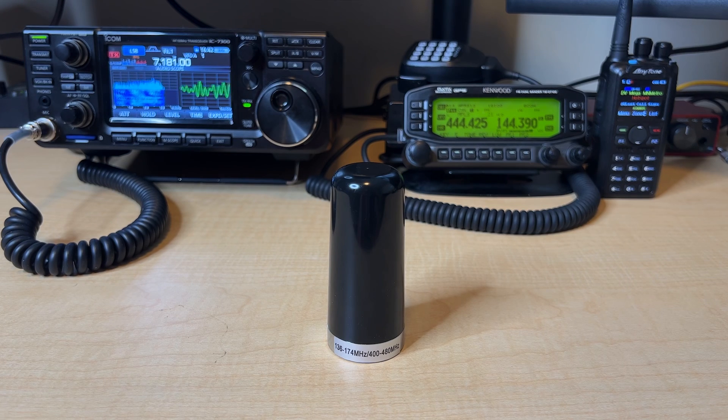So what's been my experience running this antenna for about a month and a half? In an urban area where repeaters are plentiful and coverage is strong, on UHF this thing is a usable antenna — okay at best. It's not a good or great antenna, but on UHF it's at least usable. If you have rock-solid UHF repeater coverage and want a lower profile antenna, this may fit the bill. But if you're in a rural area needing to punch out 25 to 35 miles to a repeater, this is definitely not the move.